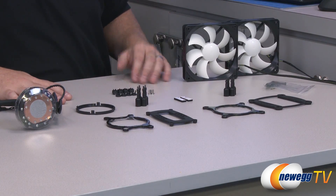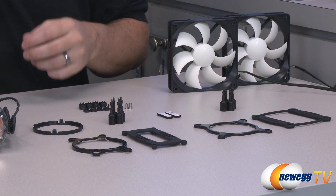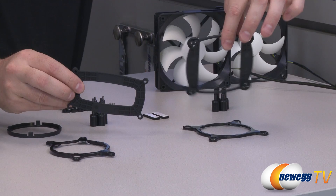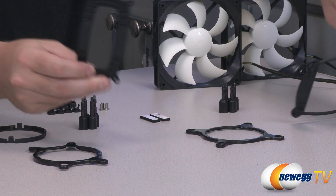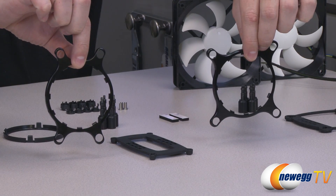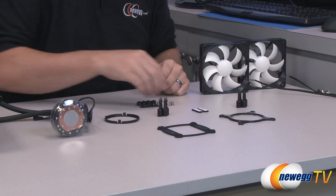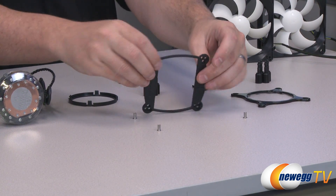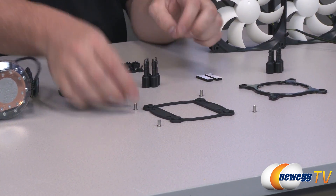Here's a look at the accessories that are included. In this bag, you have some longer screws with washers for mounting the fans to the radiator. There are plastic backplates: the one on the left is for Intel sockets except Socket 2011, which has a universal mounting plate. The other is for AMD sockets. Each has matching retention rings with teeth. For installation, you place the backplate behind your motherboard, take these four metal plugs, punch them through the appropriate holes, and that gives you threading to mount the screws to.